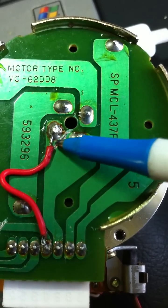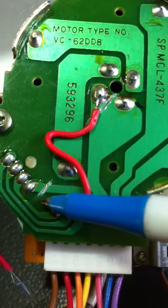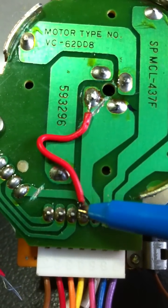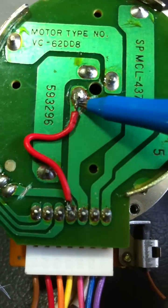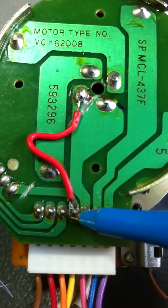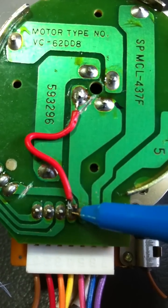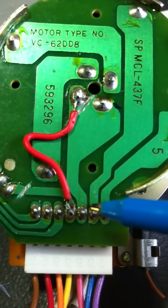You need to cut the track across here, separating that pin from that pin, and cut the track down here, just so you can use this pin here. Then you just run a short jumper lead from that pin there to that pin there. That gives you your four points across the bottom here, which will give you your two bifilar wound coils.